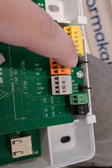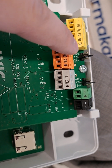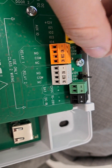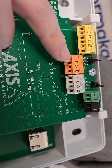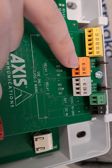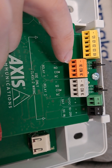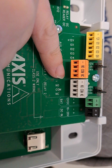You do not need an external power supply for your door strike because you can set the power right here — 12 volt or 24 volt. If you leave the jumper on common, your door strike will need an external power supply. If you connect ground and normally open, you can power a fail secure strike, meaning if the power goes out the strike locks.